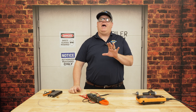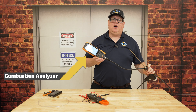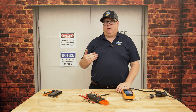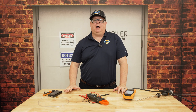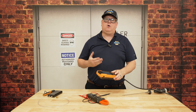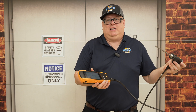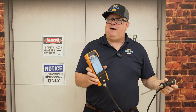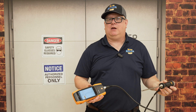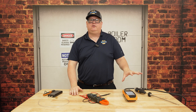The second thing we've got to have if we're a combustion technician is a combustion analyzer. The days of just eyeballing combustion are long gone. We've got new emissions requirements and higher fuel costs. So if you're going to touch the linkage on a boiler — even to reset air at low fire better for the pilot — you've got to have a combustion analyzer to verify and document what you've done. We don't want to make carbon monoxide. We don't want incomplete combustion or unstable combustion. The analyzer ensures that we can verify what we've done.